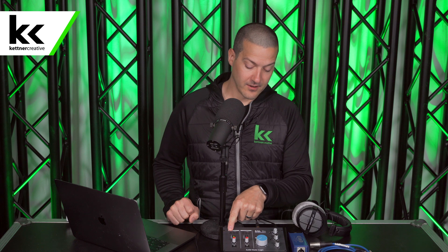So what is phantom power? Phantom power is an optional 48 volt power supply that's available from most audio interfaces or audio mixers, which can be sent over an XLR cable to power microphones. Generally speaking, you only need phantom power for condenser microphones.